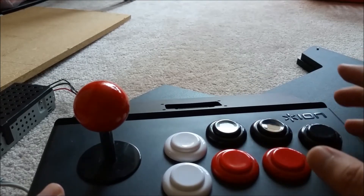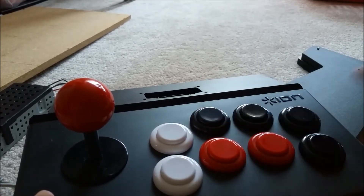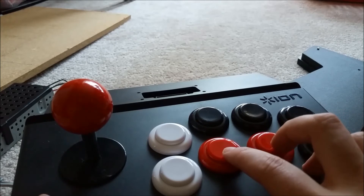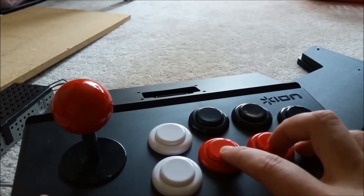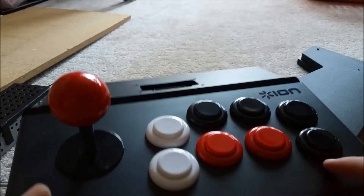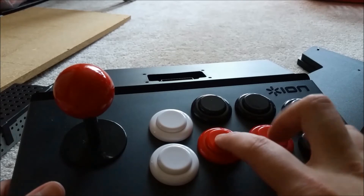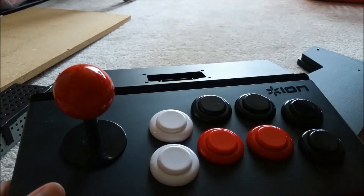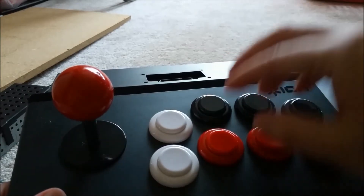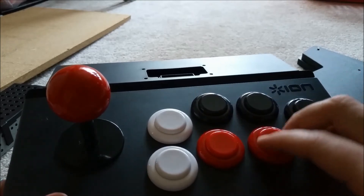I've moved around the buttons to suit Game Boy games — so we have A, B, Start, Select, and whatever other buttons you need to exit the emulator or change settings. I was also thinking of eventually getting some clear arcade buttons and sticking NeoPixels and an Arduino in the bottom so I can have them change color. Depending on what system you have selected — if you have Game Boy selected, it'll light up the two buttons red. If you select SNES, it'll have the Super Famicom colors: red, green, blue, yellow. There's a lot of cool things you can do with RGB LEDs under clear buttons.